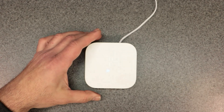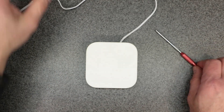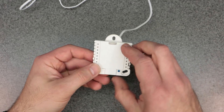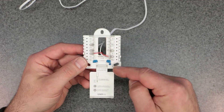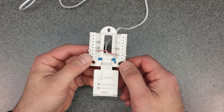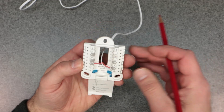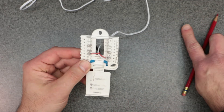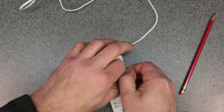Let me pop off the base plate and show you how this thing is connected. I'm just going to unplug the unit just to be safe and pop off the base plate. If you don't know, this Amazon thermostat is actually a Honeywell thermostat — it's Honeywell Home technology. As you can see, this is a Honeywell UWP base plate, which is very common to see on Honeywell smart thermostats. I'm going to disconnect this and show you from scratch what I've got going on here, because it's just going to be easier to see.